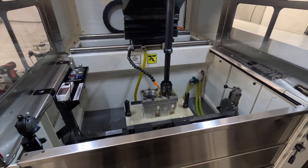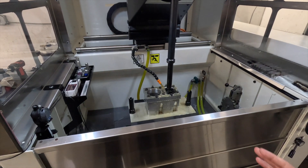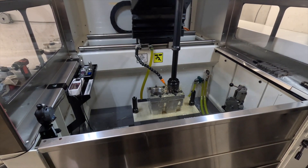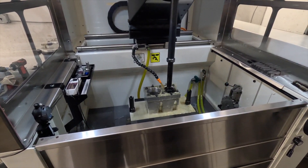Through trial and error I've determined that about seven-and-a-half seconds of this finish pass is typical. It's around only four percent load, which is just a nice light touch — we take some off and then put the shorty shoe on.